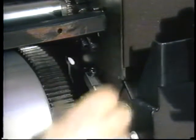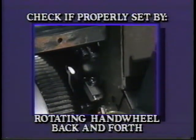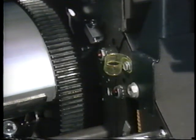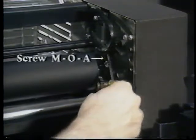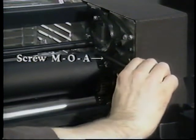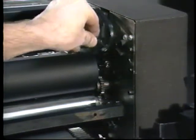Then lock with screw FOL with the dampener in the off position. Set the anti-bounce for the form roller with screw FS. To check if properly set, make sure the form roller bracket does not move by rotating the handwheel back and forth. Then tighten screw FSL. Check the dampener lever to be free-moving. To set the oscillator to metering roller, adjust screw MOA for a bead line of one-eighth inch to three-sixteenths of an inch using twenty-pound bond inked paper. Lock with screw MOL.